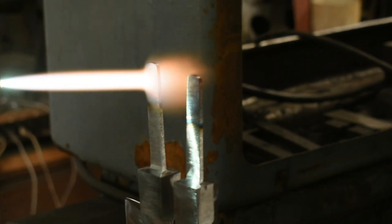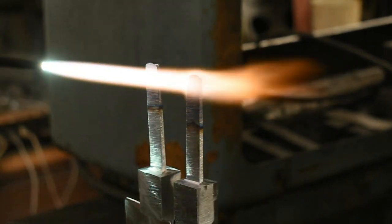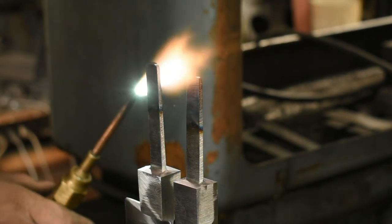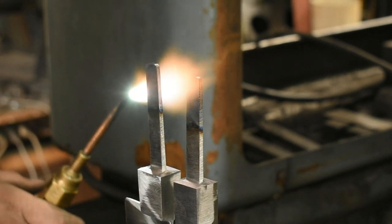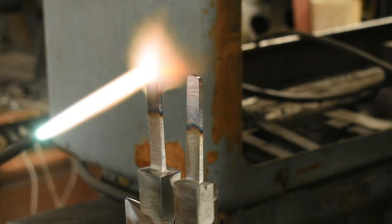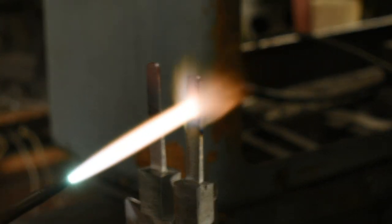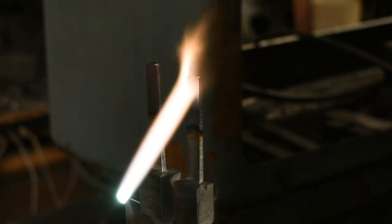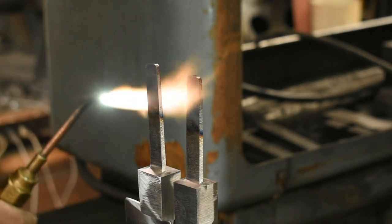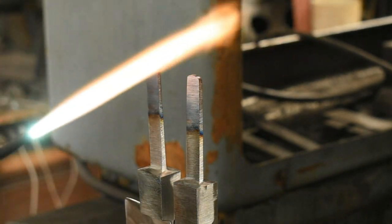I was grabbing both of these blades by the tangs when I quenched them, so the ends of the tangs probably didn't get an optimal quench anyway, which means that they weren't as hard as the blades. But I don't like buying too many bandsaw blades when I don't have to, so to take it easy on the teeth on my bandsaws, I like to get these nice and soft before I try to cut a slot in them.